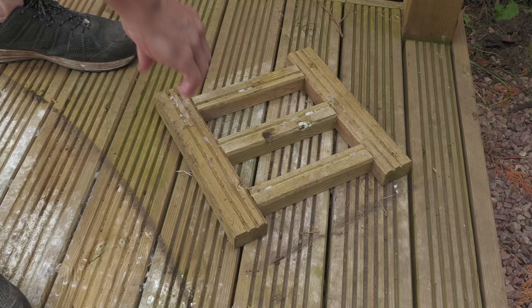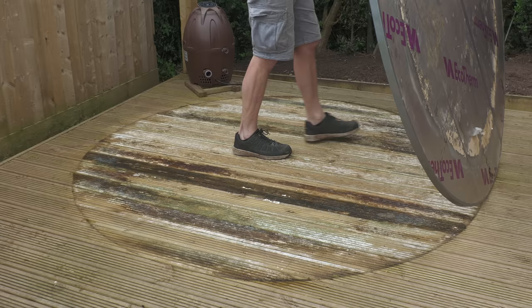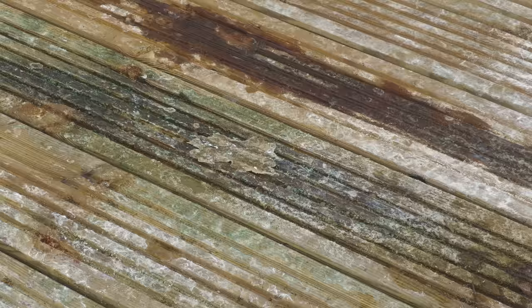But why do I need to oil it now? Well, it's actually weathered pretty well this winter. But as you can see from these visuals, the deck was looking a bit tired, mostly just dirty and a bit green in places. I also got a nasty surprise when I lifted up the insulated mat I laid back in August to find the foil had delaminated under the pressure of the water above it. And the deck was looking slightly rotten underneath because the water hadn't been able to properly drain away. Luckily, the damage was only superficial, as you'll see shortly.